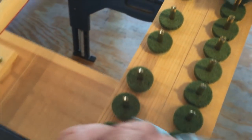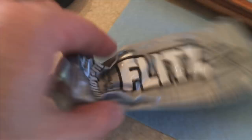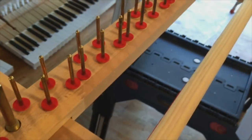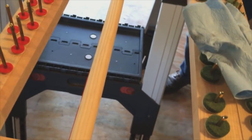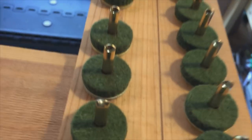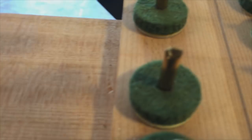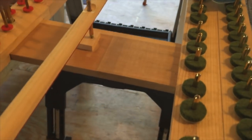So now we're going to polish the key pins. We use a material called Flitz that works really well for cleaning brass and metals. It does a great job of removing all the gunk and buildup that are on these pins. We polish them well and then clean the polish off before applying a dry film lubricant. You can see the difference — this is after and this is before. You can really see the difference just by looking, but more importantly you can feel the difference. They're nice and smooth.